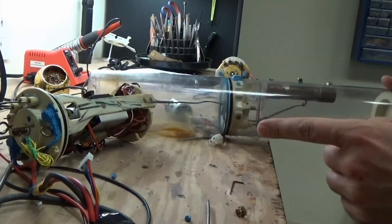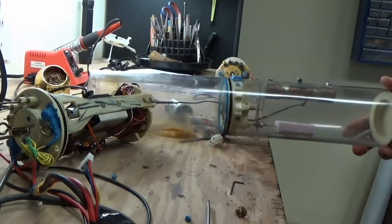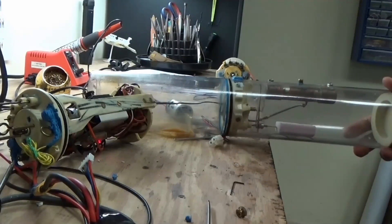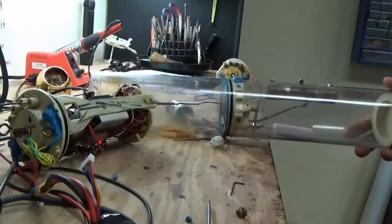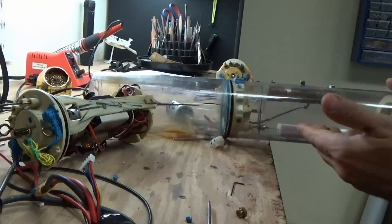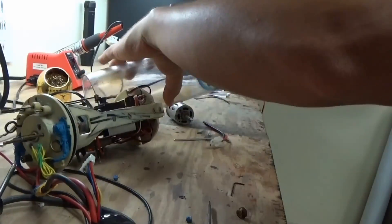The other thing this particular cylinder has is a fail-safe device. I'm going to turn off my radio here — there's a 7-second delay and it's going to blow the tank theoretically. There we go. So in case of a loss of signal, turn the radio back on, and the model will automatically blow ballast and bring the model back up to the surface.